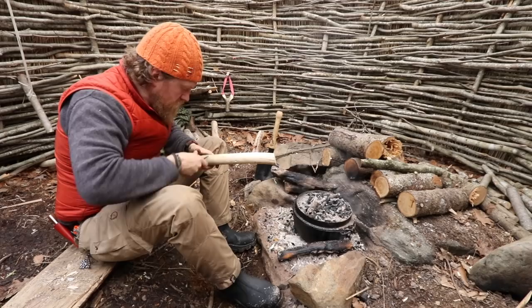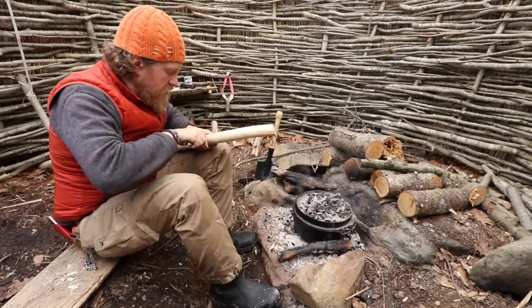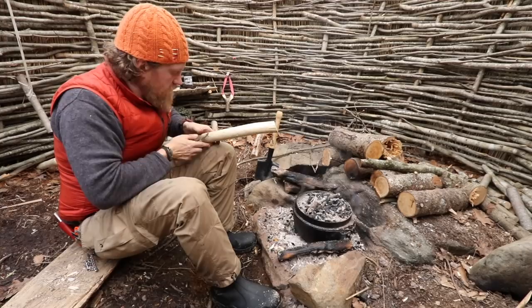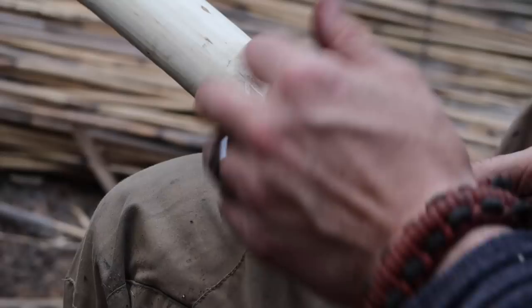And the key to working and carving is control, and remaining within that tool's bite limit. Which means each tool has a certain size stroke that works along with its bite limit. Like you wouldn't take a small knife like this and try to shave a giant peel off of something like this. It's gonna shave down and come free, and then you're in wild space, which means you're hurting somebody else or you're possibly hurting yourself.